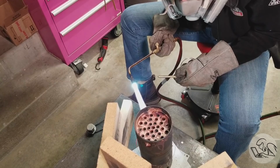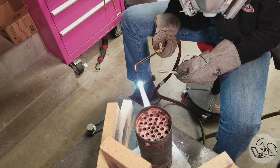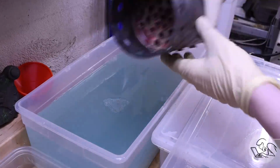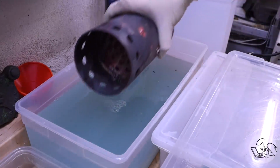But basically, you just heat the whole boiler until all the silver solder flashes shiny and chrome. Make sure to witness those joints to ensure their passage into Valhalla. What a lovely day. When you're done, the boiler will look a frightful mess. It'll be charred and black and flux residue everywhere.